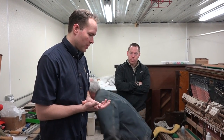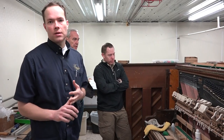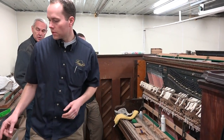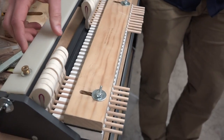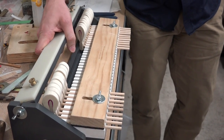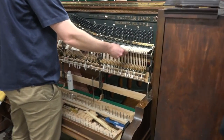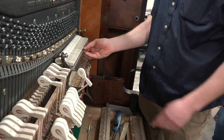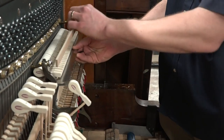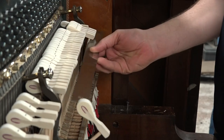So let's get everybody up to speed on what we're doing here. The goal of hanging hammers is you want a perfect straight line on two dimensions. We've got a straight edge back here, so all of these are in a straight line, and then you've got a straight edge here. When the hammers are all the way up to the strings, you want to be able to sight down. Don did a pretty good job — of course they're not spaced or squared yet — but we have a nice straight line here, and the same thing here. That's a good hammer hanging job.